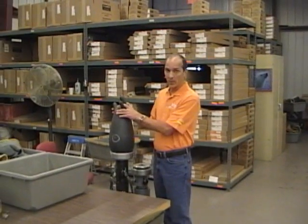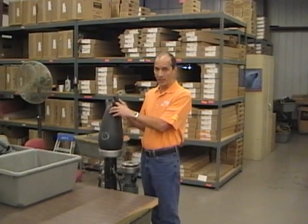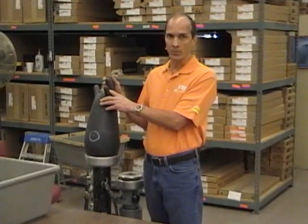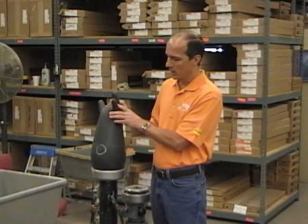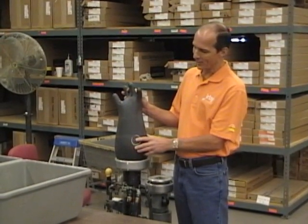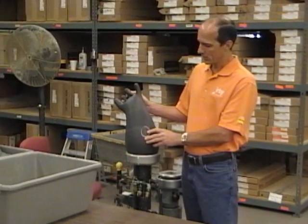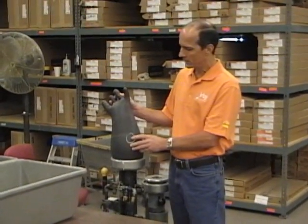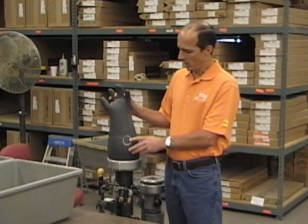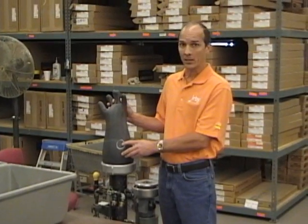The next part of the testing process is the visual inspection. Every glove, every sleeve, every line hose or blanket gets visually inspected inside and outside, both sides — all surfaces that we can — to ensure that we identify anything that could possibly be wrong. In this case, we have what we call a scuff right here, where we're actually seeing the second color, the inside color of that glove. Scuffs of that nature are a reason for ejection; this glove will not proceed any farther in the testing process because of that defect.